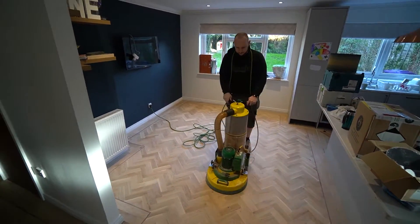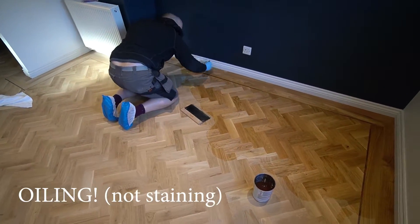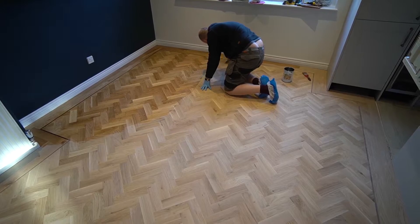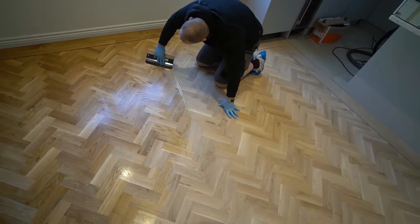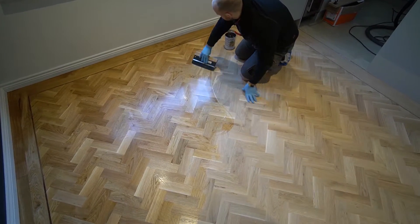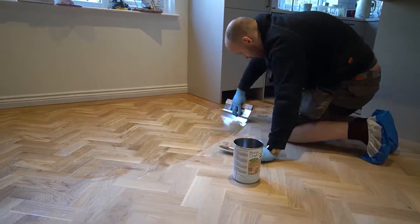This was the final pass on the trio — the very last bit of sanding. I think it was 100 grit, maybe 120. This is me doing the staining now — the video is sped up because the footage was extremely shaky. I'm using a sprung trowel just to spread the oil over the surface. I'm not trying to keep it super clean or maintain a thick wet line to the edge; I'm leaving a fair amount on the surface just to allow it to soak in and to leave some extra for buffing in the next stage.